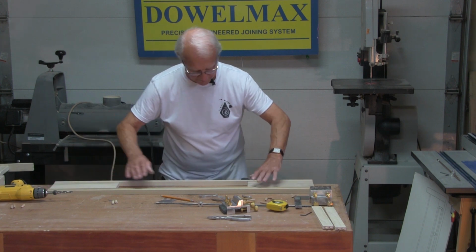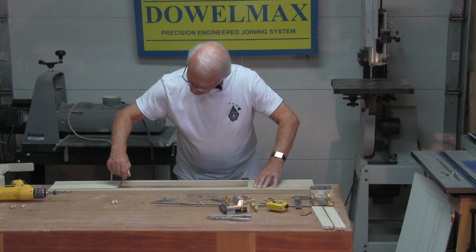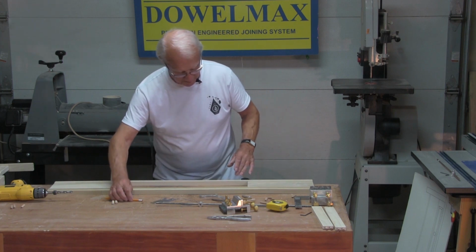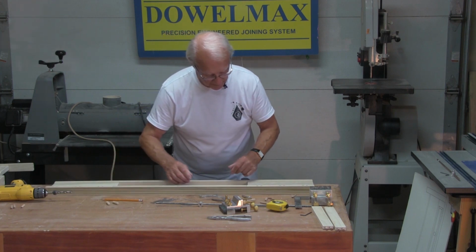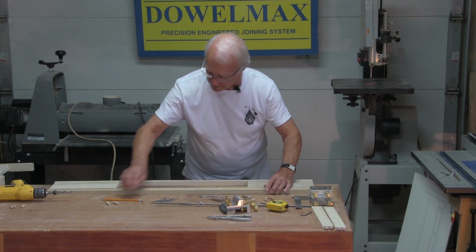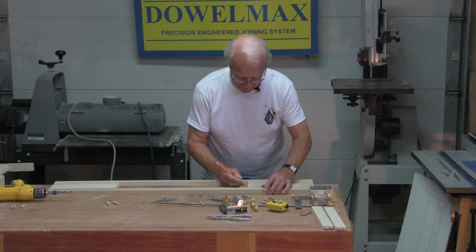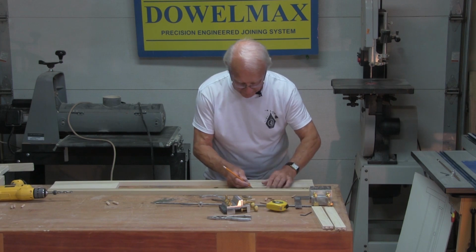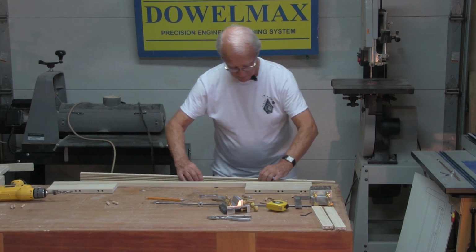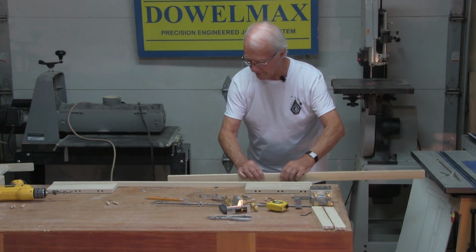The other thing you do here is, once you've got it set in position and absolutely flush everywhere, and you know exactly where everything's going to go, you put a fine line on all 4 intersections there. There, here, there. And then that gives you a reference mark, and you've got your other reference marks here, 1, 1, 1, and the next on the surfaces to be drilled. So they're actually going to be referenced from the rear.